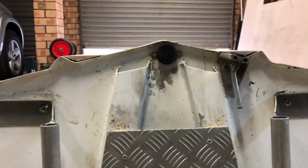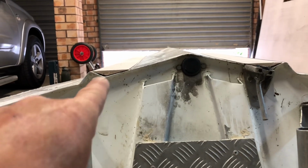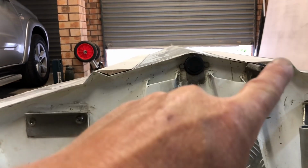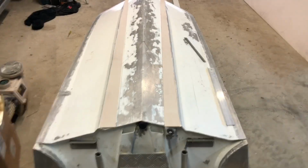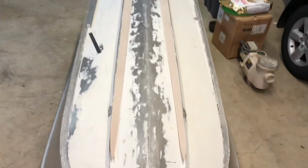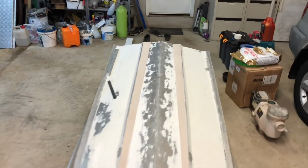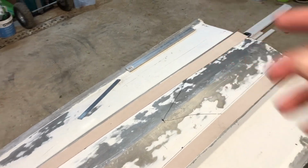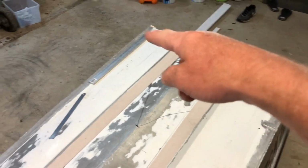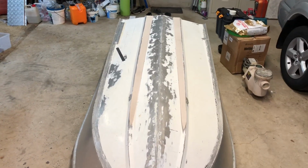So as you can see now, filling in these little triangles, I'm hoping that the hull gets a bit more lift and less of a congestion point at these two points here. Like I said, there is still a wedge shape in those strakes, slightly leaning inwards to that center line. And I really don't think that's going to affect it much, as I'm only going to be sitting on this little back pad here and hoping that these sections of the hull are actually out of the water. So we'll epoxy those on and give it a go.